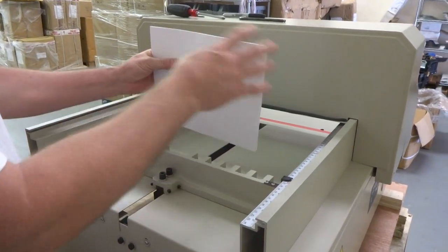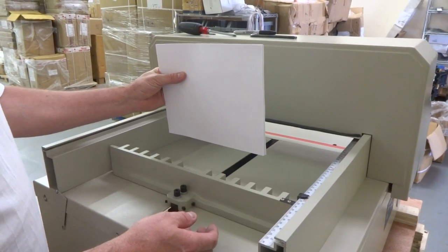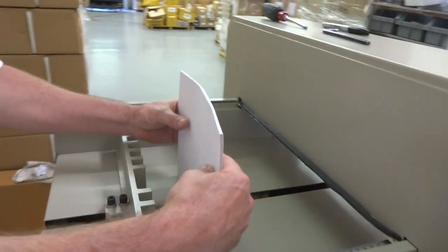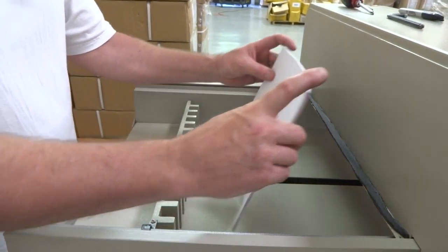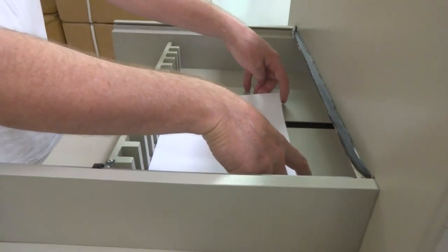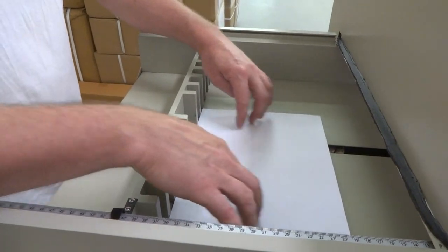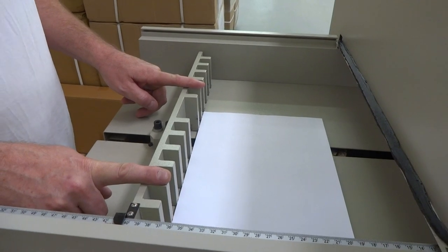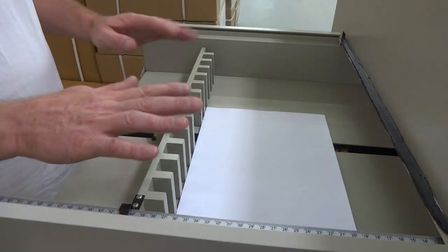This part is very important: make sure the paper is fully and completely up against the fence, or your adjustments aren't going to mean anything. You'll be here all day adjusting and never getting anywhere. The most important step is making sure the stack is nice and straight and fully against the fence. Use your fingers on the sides and the front to make sure it's all straight, and drag it against the fence to make sure it's perfectly against it. Skip the side notch and just use the middle guides — if this is straight, the cuts will be straight.